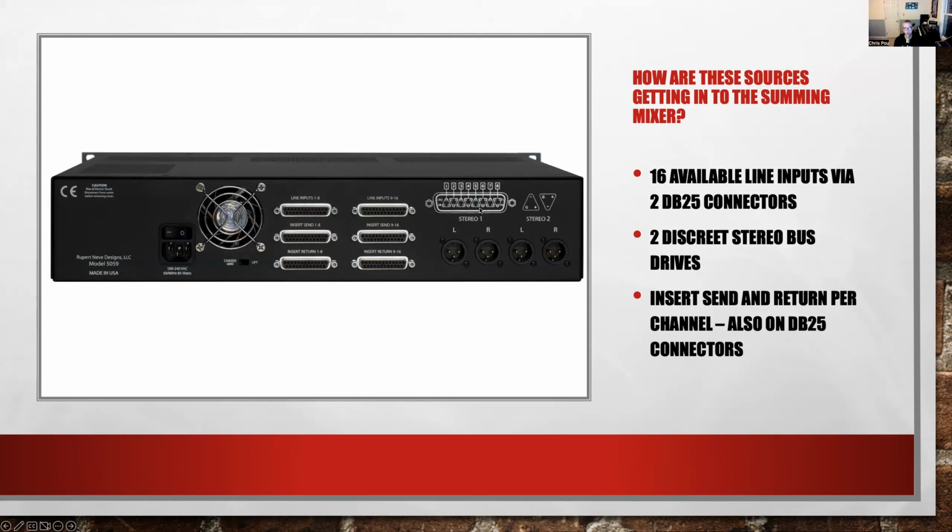All we're looking at on this side is a visual schematic and diagram of how the pins are configured on those DB25s per channel. You see your block of 8 there. And then this is just a representation of where the positive, negative, and ground polarities are on each one of those connections per pin. So you'll notice that our odd pins in this particular configuration are set up positive, negative, ground this way. Our even pins in this orientation are here, positive, negative, ground.